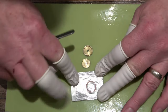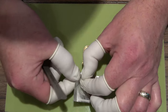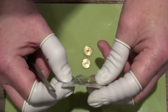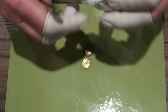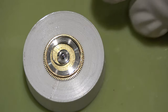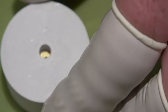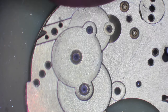We've got ourselves a new mainspring. Before I put that in I'll drop a tiny drop of oil. Now the mainspring has already come pre-greased, and there'll be a coloured side which normally goes up. All you do is press it into the barrel. With the barrel arbor in, we can put the lid on - this little tool just helps to apply even pressure.